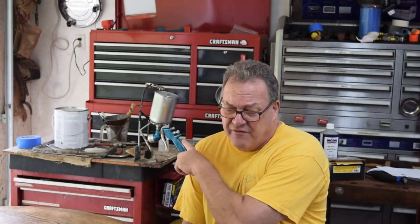So what we're going to do next is I'll suit up. I've got my toner mixed up, and we will start to identify the light areas in this table that need to be darkened, and we'll do it by applying toner. So here we go. I hope I'm going to be able to show you in this shot how this works. I've got the pressure turned down. I've got the application spray nozzle turned down so it shoots out in a straighter spray and much less material. And let's see if we can darken this up.